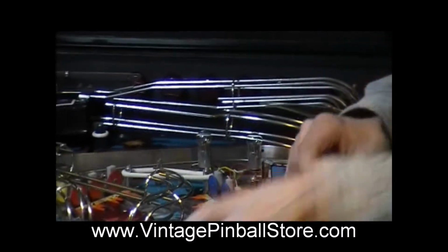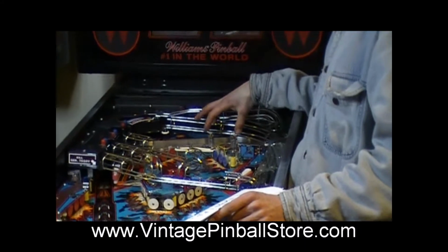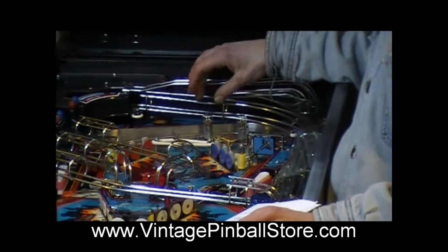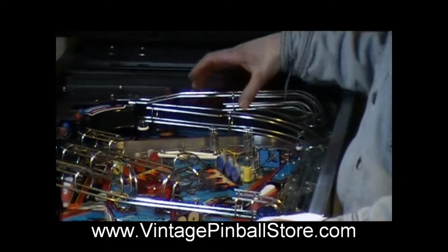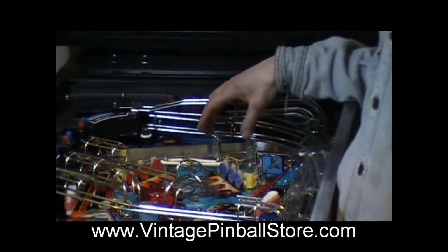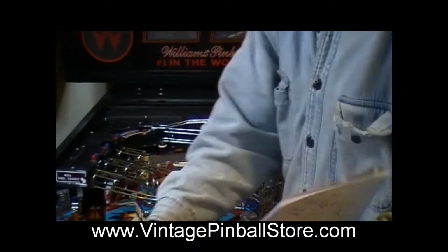Now the wiring. The way the game sits now, these two flash lamps that are already installed in the game are wired together. The early production games were not like that. These sockets are supposed to be separate. So if you go into your coil test, these will be on flasher 9. The service bulletin tells you to change two wires on these.